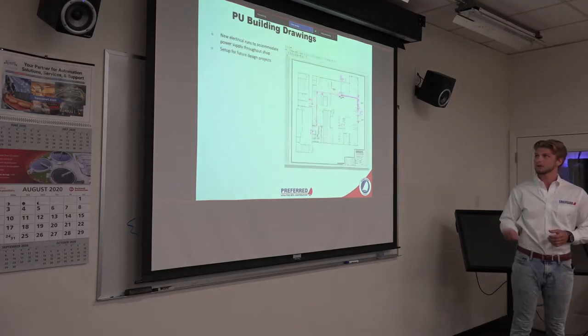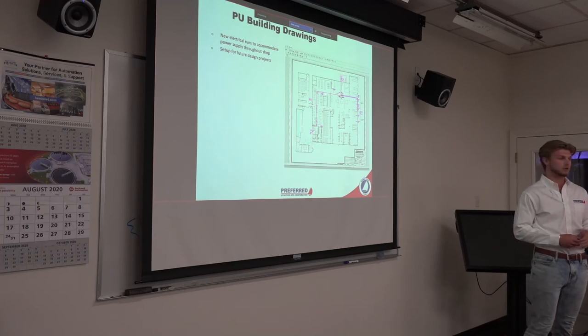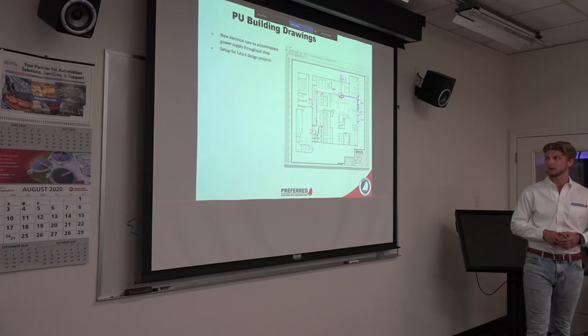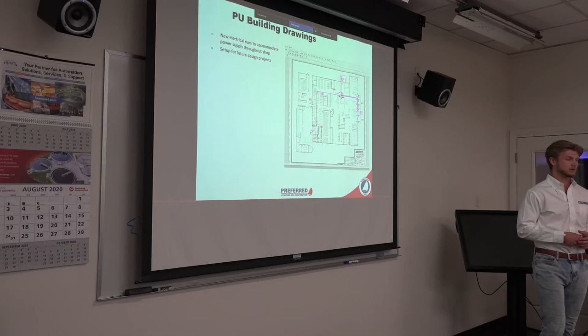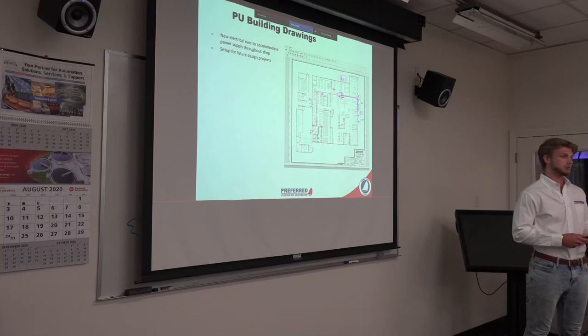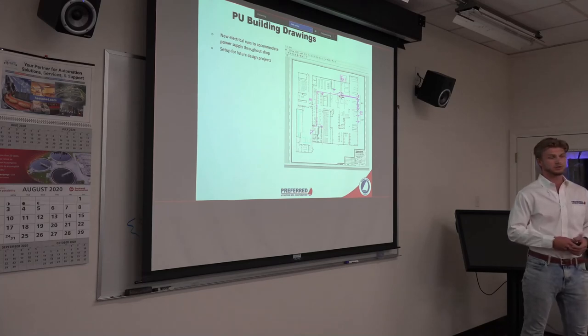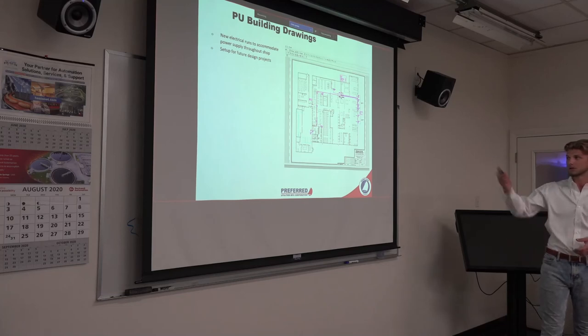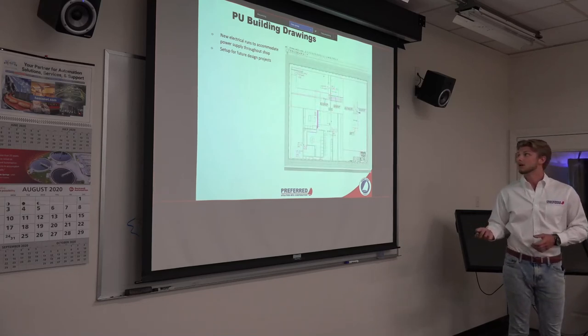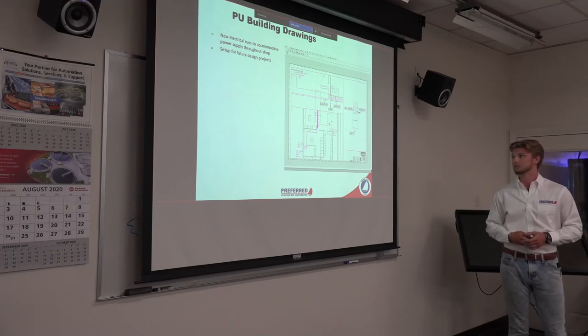And then I came back into engineering. This was presented to me later on this summer, a couple weeks back, by Dwayne, and then Rob as well. These were new electrical runs that we're going to be putting into the shop in the next couple weeks, months. Basically, what this is doing is distributing power throughout the company for future design projects. For instance, our second floor that we're going to be putting in soon. So just running a 480 bus all the way through the machine shop, and making sure everything has enough power where it's needed. It's just easy plug-in access. It's a more exploded view of a couple of different things that are going on there.